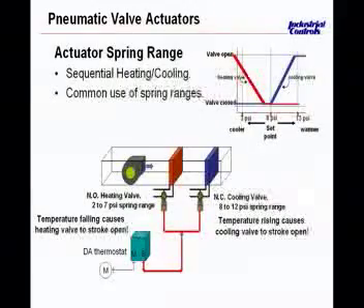What you'll oftentimes see on very large heating coils is two steam valves — a one-third, two-third scheme where you'll have one very small valve that handles very light heating loads and a larger valve that opens with an increased need for heat. In that scenario, you'd need to have a positioner on each to control the spring range and start points of those two valves so they never overlap in the cooling range. Or if you have an economizer cycle, you might need to shift spring ranges to accommodate the economizer operating sequence with the heating and cooling valves.